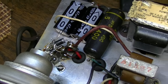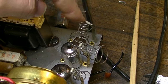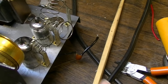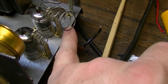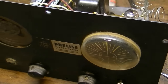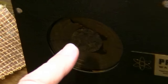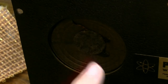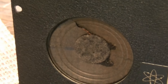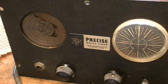I've changed the electrolytic caps and swapped those diodes. I also removed the tube in the back because it seemed like it was causing problems, and I removed the cap carrying signal to it, just for the time being. I was able to get some signal coming through, but notice we had some terrible noise, and the speaker unfortunately is ripped. So we're going to try to repair this cone, or barring that, find a replacement speaker.